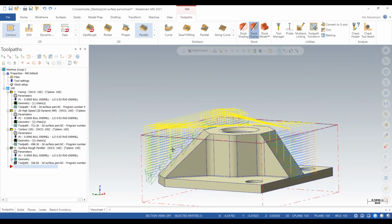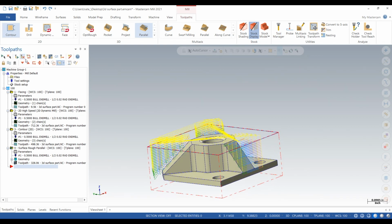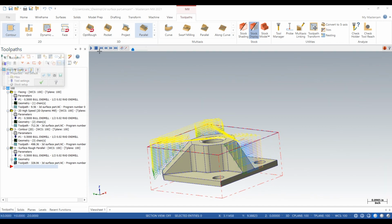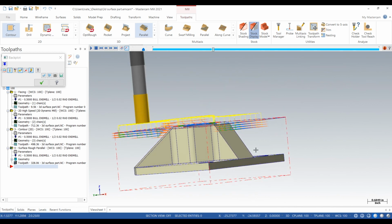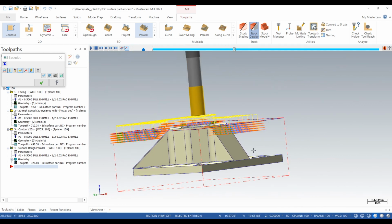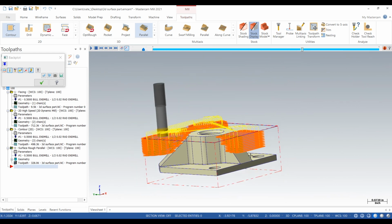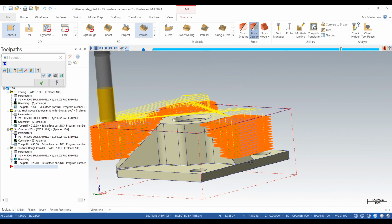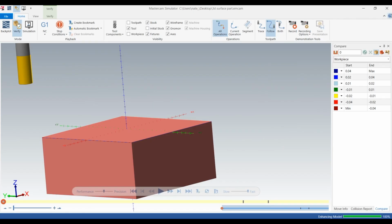and it looks like it generated the parallel 3D toolpath. So we'll just backplot it. So it's stepping down 75 thou at a time, stepping over 1/4 inch, and it's not taking huge cuts like a flow line would. We'll go into verify so you guys can get a better idea what this toolpath is doing.